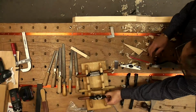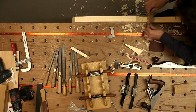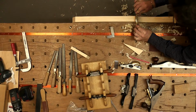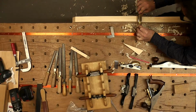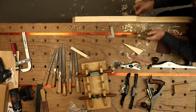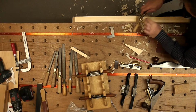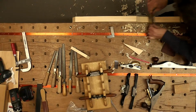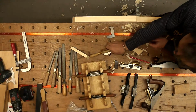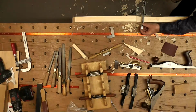Now I said you go with whatever you want. You've got a shallow curve spokeshave. I've got to work from there and come from the top all the way down. If we come up here too much, the fibres are going to lift and splinter off. They'll break out. There's no support there. We can get to there. I said to you, different things we've used. Japanese file, right.